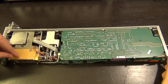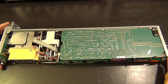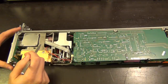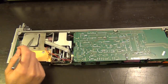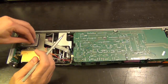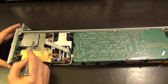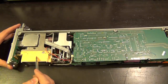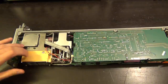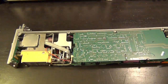Here's the optoelectronic converter section — and what a score! Not only does it have a 22 GHz optoelectronic converter, it also has a mechanical attenuator and an optical power meter built in. The optical input comes in here, goes into a cover section likely based on free-space optics, and there's a motor here that adjusts the attenuation by changing either the angle of a component or the polarization of an optical filter.